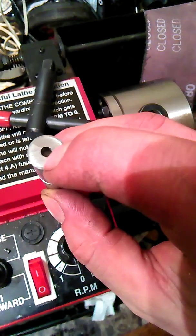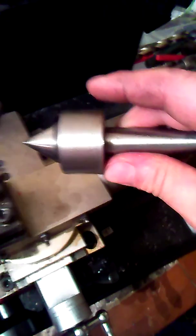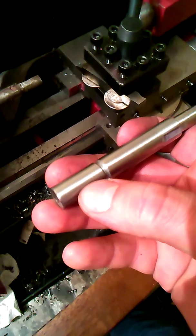When I was turning it, I put it on a live center so that when it was spinning I could get it truer and it wouldn't move around, because the weight of the tool and the tool pressure moving into it would cause my shaft to move out, knock it out of concentricity, cause my runout to be out and all that. So I mounted it on the live center. Came out nice. I may post another one if I put that set screw hole in there.